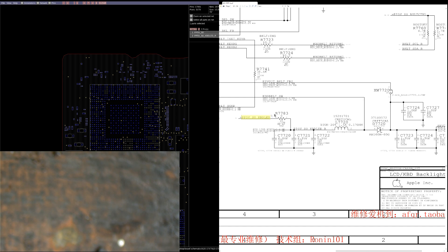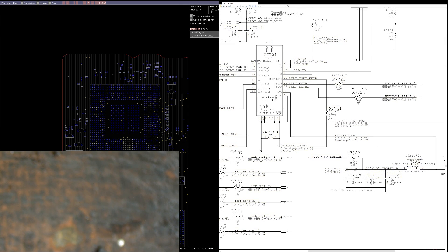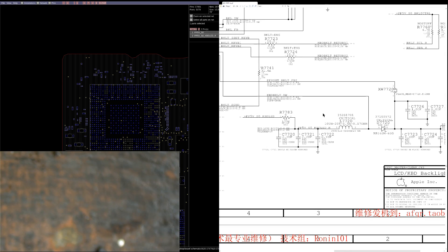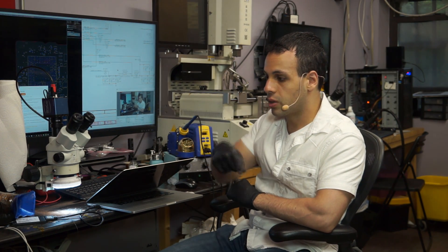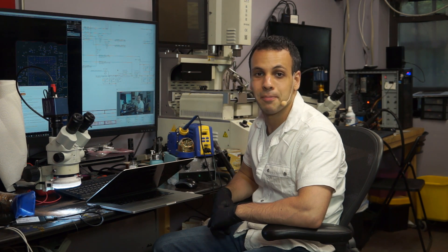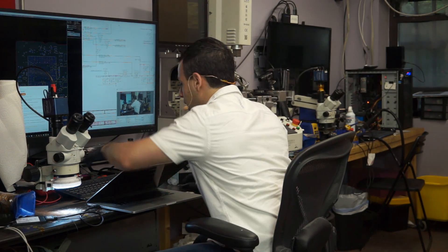When we use a DC-to-DC boost circuit, five volts come through here. After the coil there's something that switches the ground. On this chip — the backlight chip — we have SW2, the second switch. The first switch is for the LCD backlight; the second one switches the keyboard backlight to ground. So it stops short, and for a quick second we get a spike of 25 or 30 volts instead of five. It would be uncomfortable if somebody kept stopping short hundreds of thousands of times every second — but that's exactly what we're doing to the electrons.